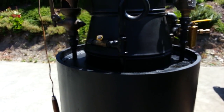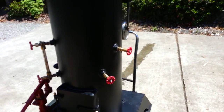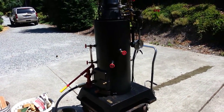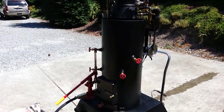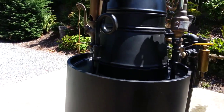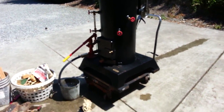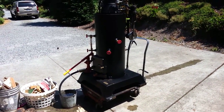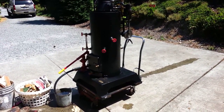You can probably hear it — it uses steam. If you've got it going with steam pressure, you just open that up a little bit when you put new wood in, just for a minute or so, just to start the new wood burning. It really draws in a lot of air because it goes up the stack, draws in air underneath the fire, and gets the fire going real hot and fast.